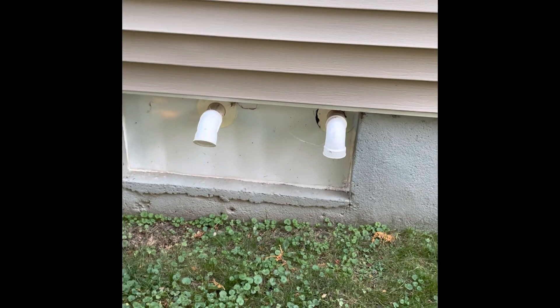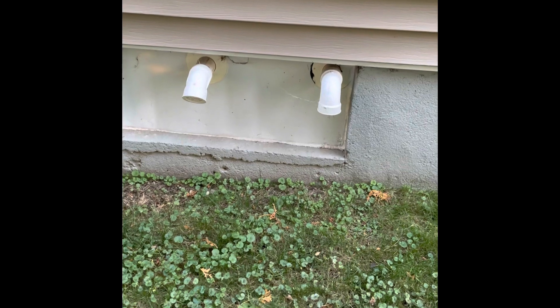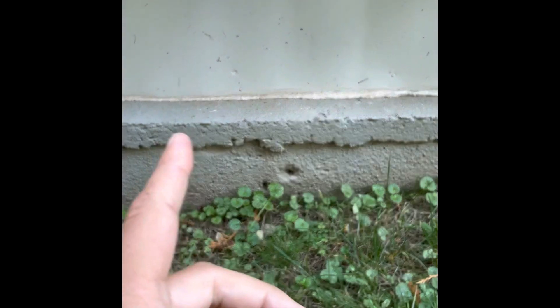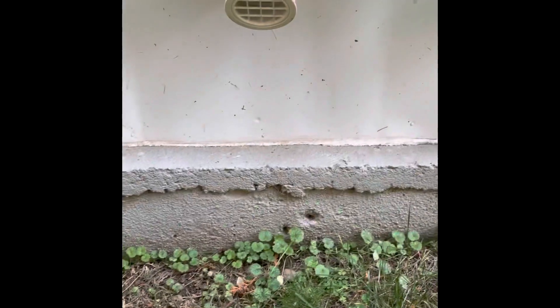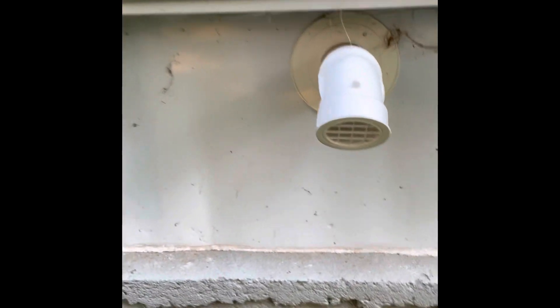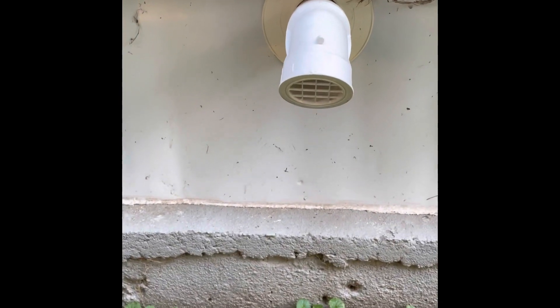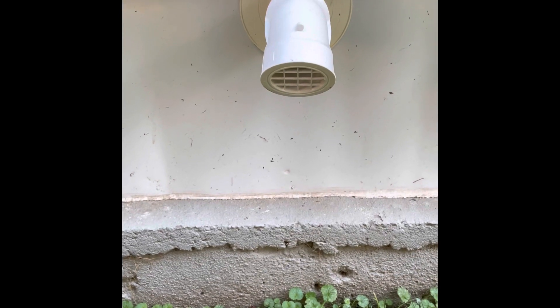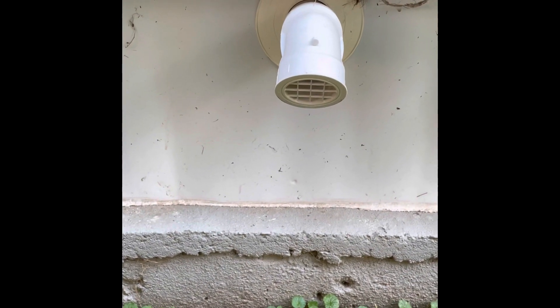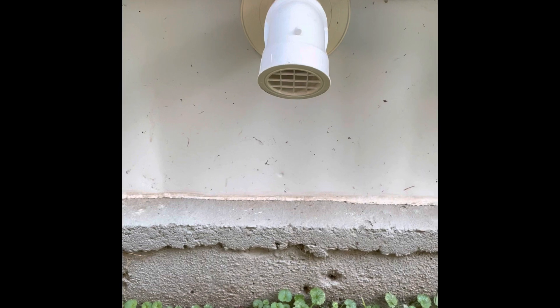Now we're at the foundation where the intake and exhaust for the system are evident. What I find a lot in the wintertime is when it gets extremely cold, when the exhaust comes out, it actually gets a snowy-like texture on it. And what that does is it blocks the vent so it cannot exhaust the flue gas correctly. That's a really good safety feature — you don't want gas exhaust backing up into your home. I've come out here and there's literally just been a little bit right here, but it's just enough to set that system off and hit that safety measure to shut your system off.